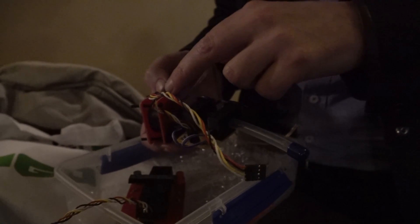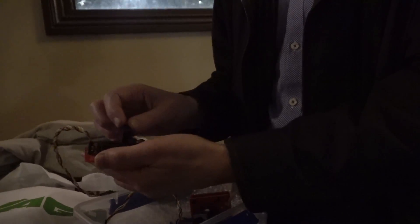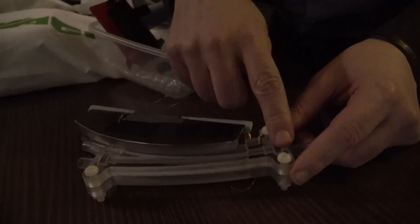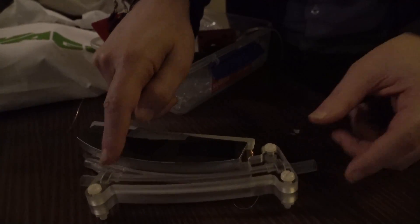Good old Arduino controls the timing for the electromagnet. The throttle changes the parameters in the software — it's more subtle than just giving it more power. There's also an atmospheric pressure sensor so you can check the pressure. The part I'm excited about is — after piles and piles of versions — I've finally got the geometries right in this CNC-milled acrylic, such that the ball comes in and follows the outside track.